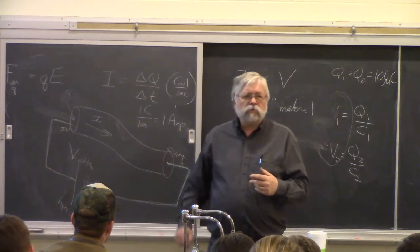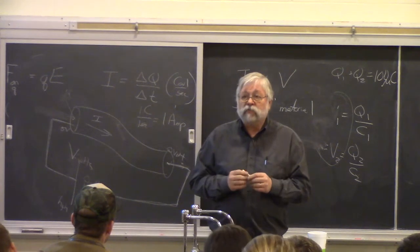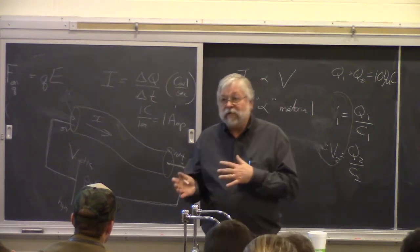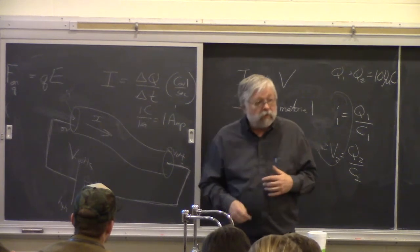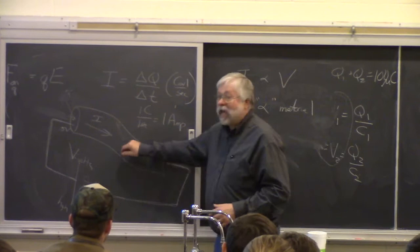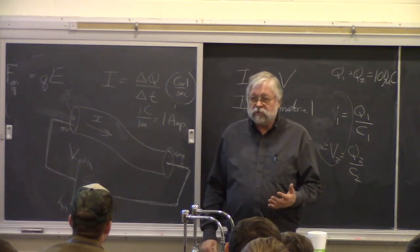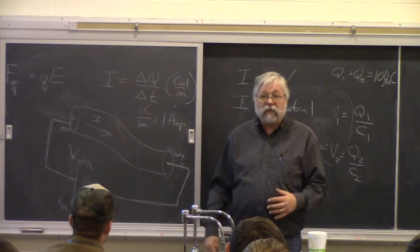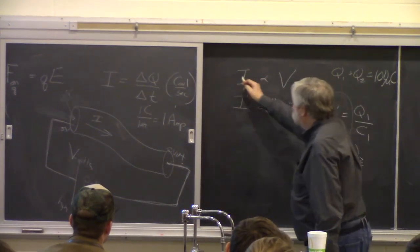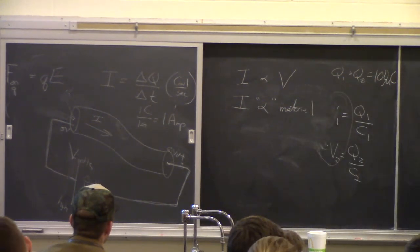It had some sort of an interface between 2 types of semiconductors. One way allows charge to flow and the other way doesn't. So there was a difference in material, there was a difference in current. When you put a piece of wood or plastic or something here, you got so little current that you said it wasn't conductive because the bulb didn't light up. So not only does bigger voltage make for a bigger current, but the material influences the current too.